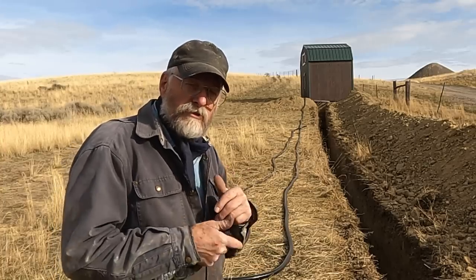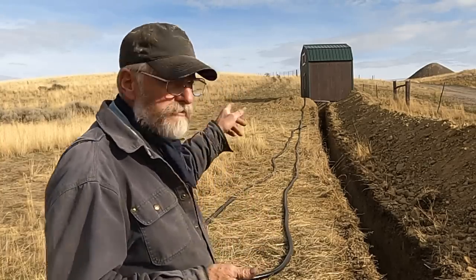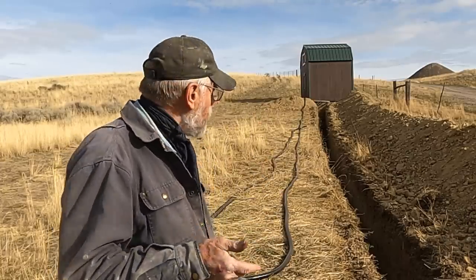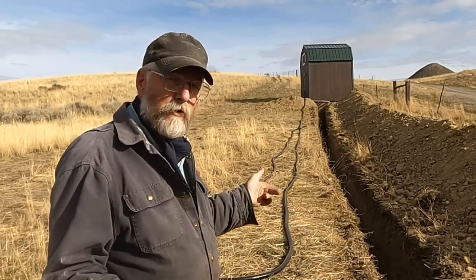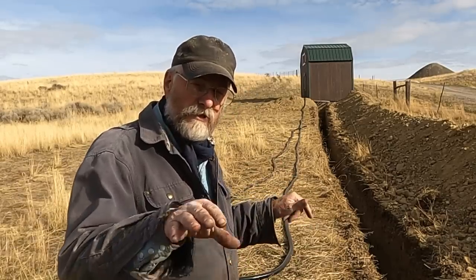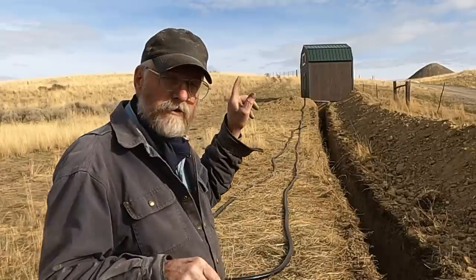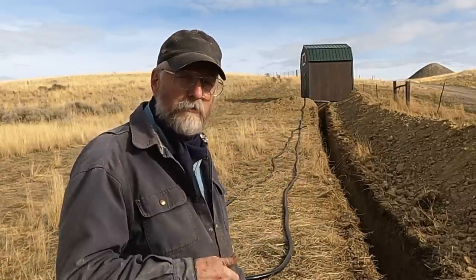So I bought 1.5 flexible PVC water line, and that's what I have stretched out here. It came in a big coil. We've got a little sunshine today. I've stretched it out to kind of relax it. These come in 100-foot rolls. I have 2 rolls that I'm going to splice, bring it down to this frost-free hydrant and plumb it into the building. Then I'll run my little Bobcat out here and start to backfill this thing.